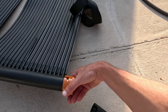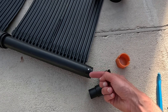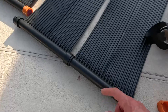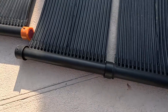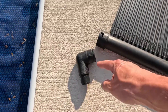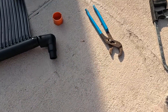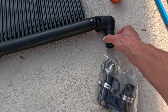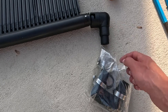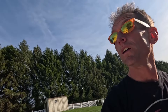It comes with these orange caps on - take the orange caps off. There's an o-ring you put around there, it's in the bag. Take that cap off, it'll snap in there, and then this other piece will go right into there. There's a little o-ring that comes with it, you put it in there. Then you're going to take these hooks here, hook the pipe in, and double tighten the inch-and-a-half flex pipe onto there. You will need a socket set as well.